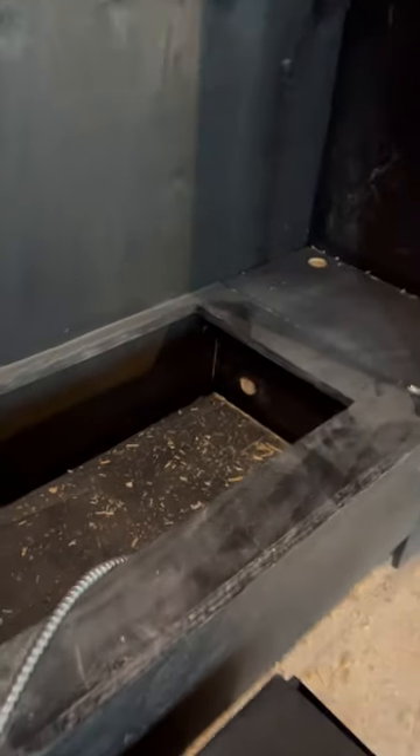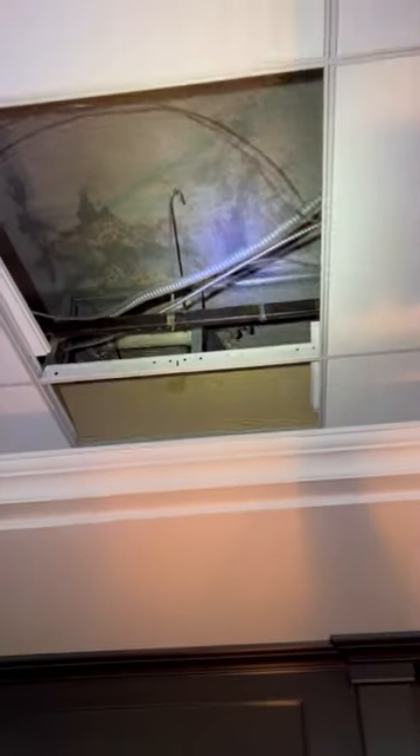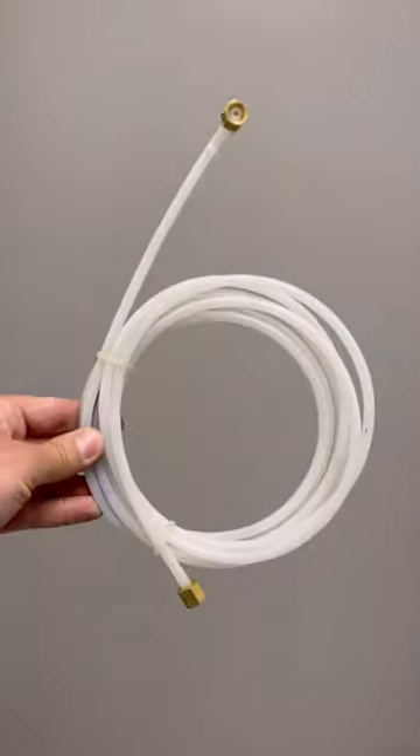The super said to run a quarter-inch copper tubing from the kitchenette to the fireplace. I didn't love that idea because it would have to be run in the ceiling, and even if I tried to support it in multiple places and been super careful, the tubing would probably still touch other wires, ceiling supports, or could even kink in multiple places. So I started asking them where the closest bathrooms and kitchens would be in the apartments above to pinpoint where the risers go up.